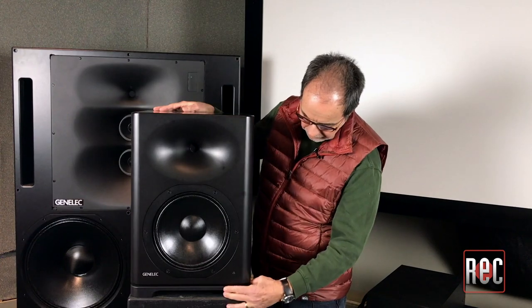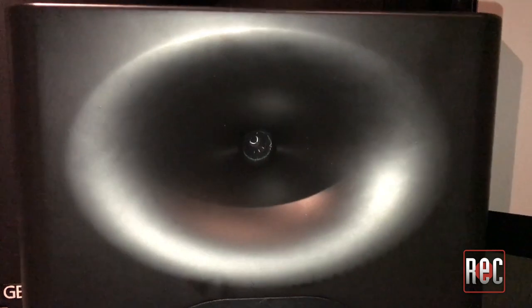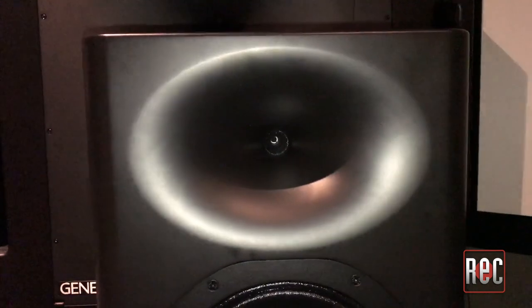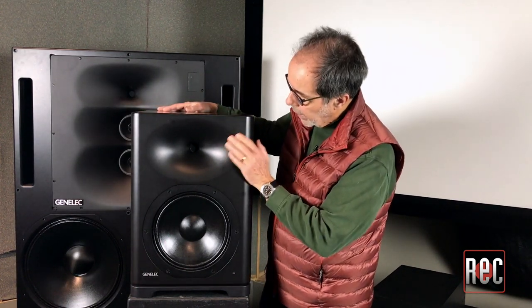The cabinet is completely isolated from the mounting surface by this very unique isoplate. Now let's talk about the S360A's new waveguide. In order for this product to present itself as a high SPL product, the tweeter is a custom designed 1.7 inch high compression tweeter with a 1 inch throat. The waveguide has a geometry of a more long throat type — it's very deep, it's very smooth — and we refer to this as the extended waveguide or extended DCW. This combination gives the product beautiful natural off-axis response as well as ruler flat on-axis response.